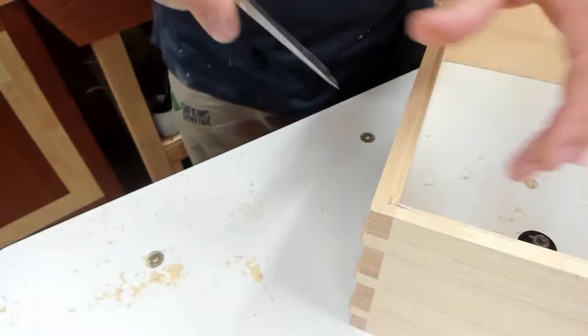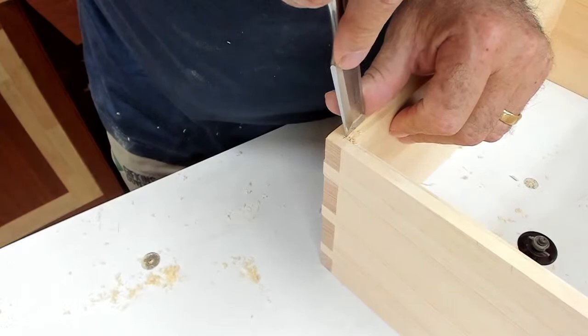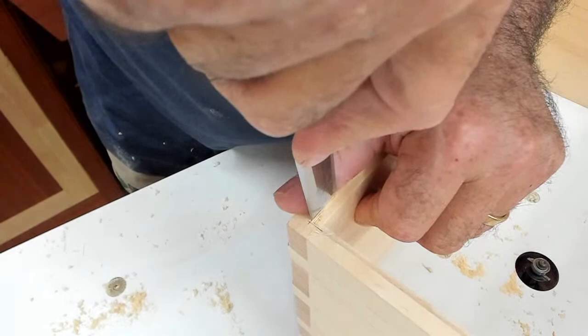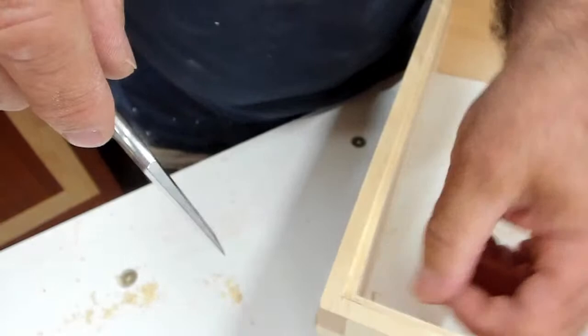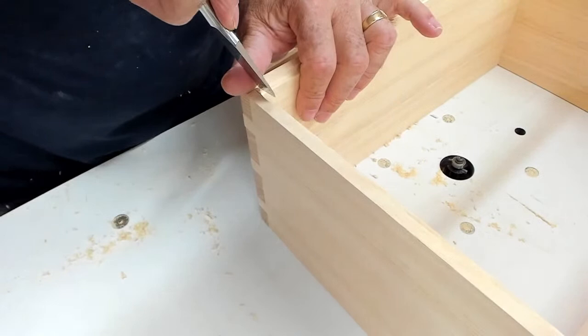A lot of people who don't do that, and they end up with band-aids. Particularly when you've got nice sharp blades, I tend to sort of err on the side of safety. It's better to use a sharp blade than it is to use a blunt blade. So spend the time learning to sharpen your chisels. You'll notice I'm not even using a mallet for this, and I'm getting beautifully clean corners. This one here, I cut across the grain first.